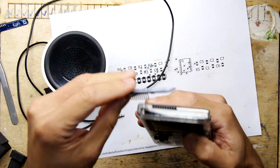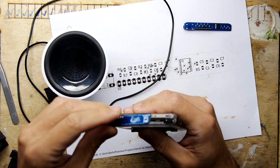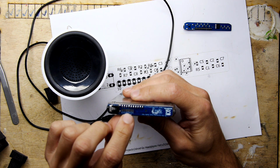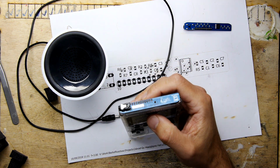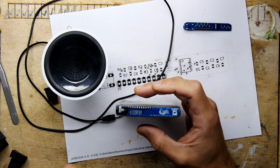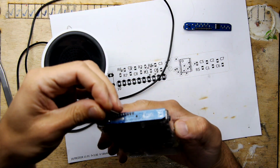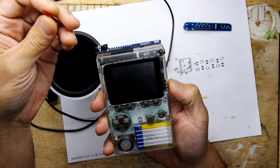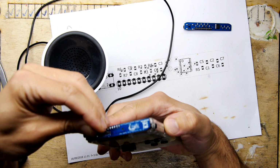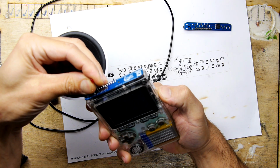Let's have a look at the hat. I'm going to use the one which doesn't have the X on. If you see at the top, there's a 3v3 line and then there's a ground line. So I need to experiment by putting a bit of a load on that 3v3 line. And we've got a diode here. Basically, what I was doing before was playing with putting loads on that. Because the SD card is running off that bus, it does seem if there is a certain amount of load there, you'll get an issue with the SD card.